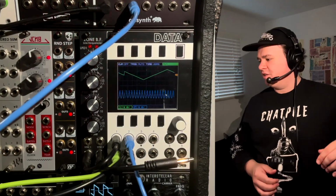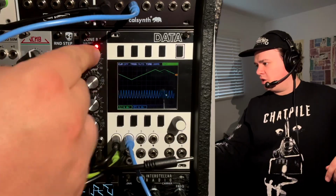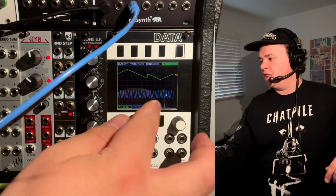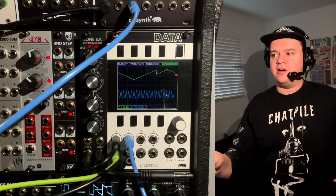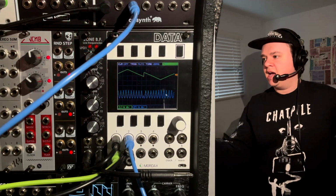So hopefully the scope will give you some information here. What we have on the first one is the output of our LFO1. So right now I'm in triangle mode. You see that triangle going. And then the blue trace is the audio coming out of our chain. So the chain is triangle wave, an analog one from the wave transformer, as basic a waveform as you can get,